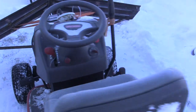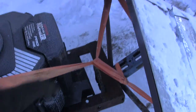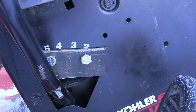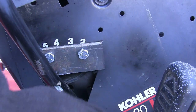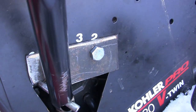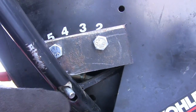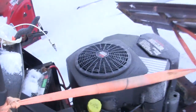My camera battery died partway through the video so I had to charge it up. Anyway, I got those two plates on the bottom there to stiffen it up. One other thing that broke was the handle — the little teeth that this pin used to sit in folded right over, so I went ahead and got a lawnmower blade and cut a little notch into it so it'll hold that. I think the next problem I'm going to have is this pin is going to wear and bend that over, but I'll deal with that when it happens.